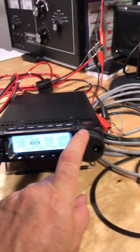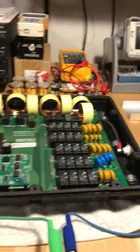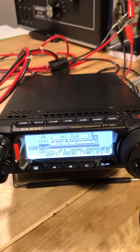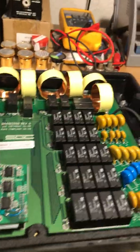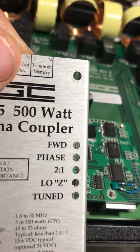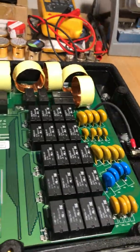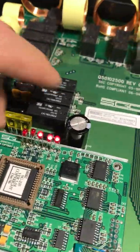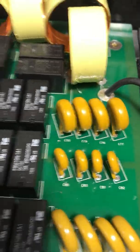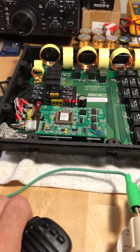Here's kind of the issue — it sort of remembers that for some bands but not always. If I go over 18 MHz, this should have something in memory but it doesn't. What happens is I key up, the radio shows infinite SWR, so really high SWR. The tuner is somewhat confused — the last LED is the tune LED, and the third one up means it's greater than 2-to-1 SWR. Interestingly, there seems to be a grounding problem — that light's not supposed to be going on when I push down on that.